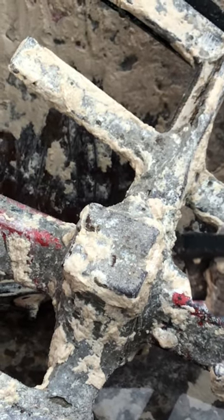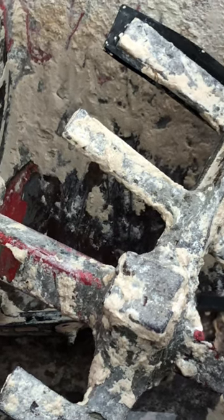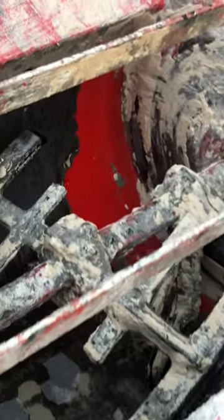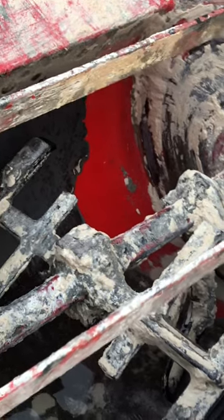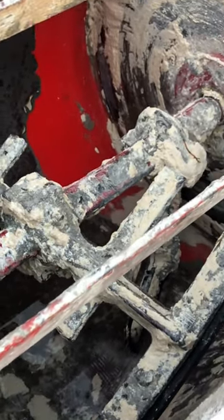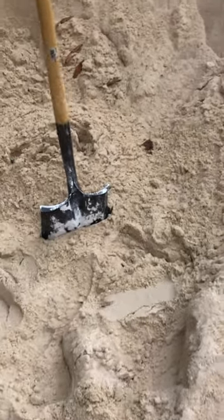I'm gonna film the whole process here while he's mixing. Then we'll test it with our trowel, make sure that it's gonna be laying like we want. But when you're adding water, be very careful to add the water slowly so that you allow the mixer to do its job. A lot of times people will dump more water and it looks dry, they add more water, but then as the mixer stirs it up, it hasn't contacted all of the materials in there, and so then it gets really soupy quick. So it's easy to over add water. All right, let's go, Darnell.